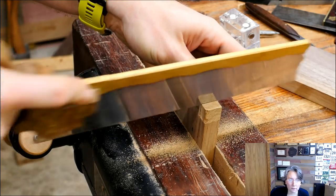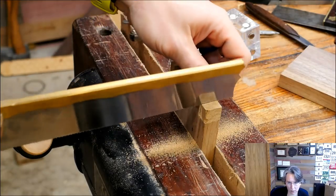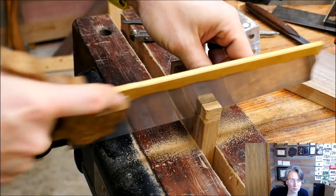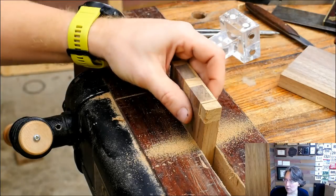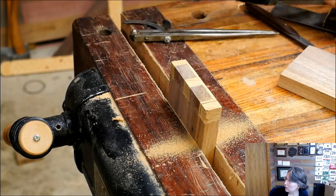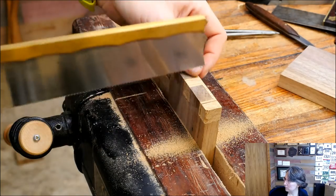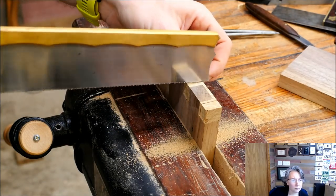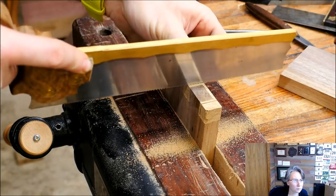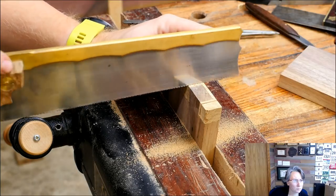Burley Woodworks asks, have you had any problems with the chisel at all? I've been wanting to make one for myself to try out one of the dovetails you're doing. The chisel. Oh, are you talking about the dovetail chisel that was made a while ago? No. Actually, I really enjoy that one. I don't use it as much for regular dovetails, but if I'm doing half-blind dovetails where I have to get back into a socket corner, that's where I pull it out most commonly. But for regular dovetails, I just use my normal bench chisels. Although some people are going to scream at me for that because they want me to use bevel edge chisels.